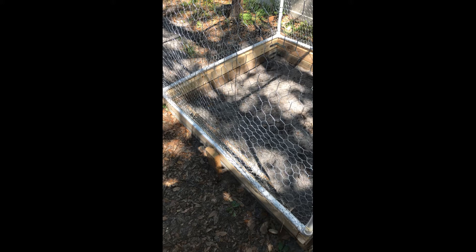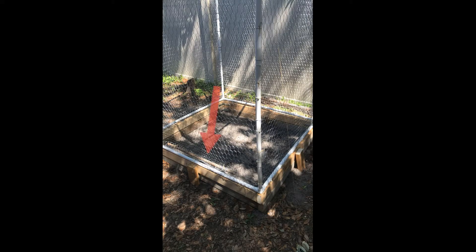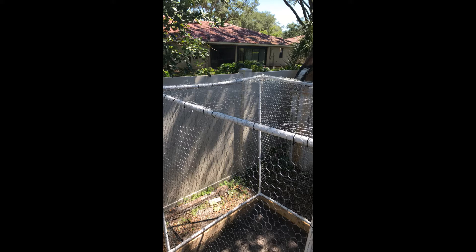The process to put the chicken wire on all four sides: I cut the chicken wire to five and a half feet, and at the bottom of the chicken wire I tied a steel pipe to keep the chicken wire from popping back up and hitting me in the face. Once I was on the side of the frame, I threw the top of the chicken wire — the end without the metal pipe — and it laid on top and kind of grabbed hold. While it was sitting up there I grabbed the zip ties and zip tied the top, then went down the sides and zip tied those, and once I got close to the bottom I took the pipe out and zip tied the bottom. I did that for all three sides.